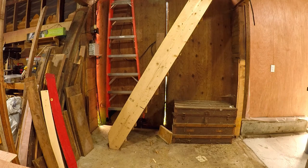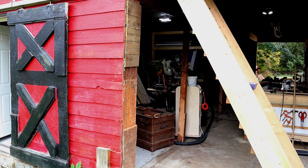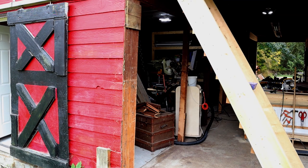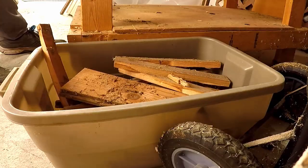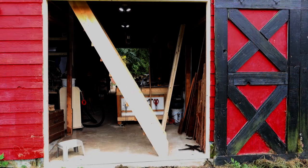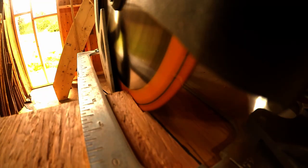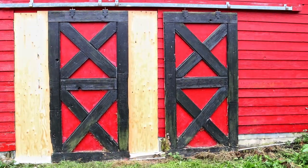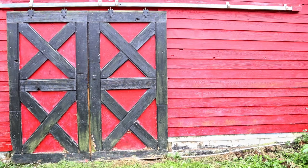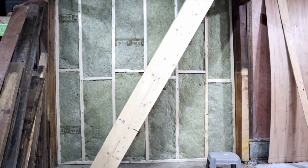Before I can close the door off, I have to clear some space, and there are some boards to be removed from these walls as well. After adding the framing, I'm also going to add some plywood panels to the outside of this wall. The doors will cover it up fairly well, but the plywood will keep out whatever the doors will not, and it'll also stop the insulation from pushing right through the wall when it's added. Now just add vapor barrier, and then paneling.